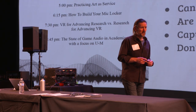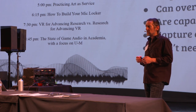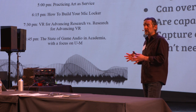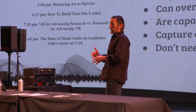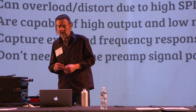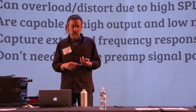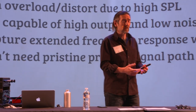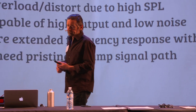There's another type of condenser mic called the electret mic, sometimes also called permanently charged. These use special types of plastics that have basically a permanent charge applied. That design had a bad name in the early days because the charge would wear off after a couple of years, but they've mastered that now and those last a long time. A lot of inexpensive microphones on the market do tend to be electrets, but even those require voltage for the circuit. You're going to have a battery, phantom power, or some other power supply — a tube microphone, for example, has its own dedicated power supply because it's looking for 120 plus volts.